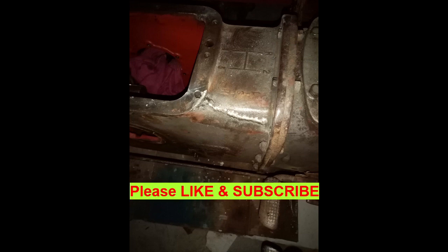It's not something for the faint-hearted, especially if you were to start cast welding. I recommend you start it on an old cast frying pan or something like that, not something that might be of importance, because one wrong, too much heat, and that'll crack like an eggshell basically. But it worked out well, happy enough with it, and no leaks. It's holding oil and it's not letting any water in, so yeah, it's a good job.